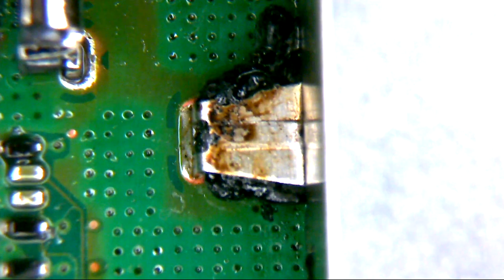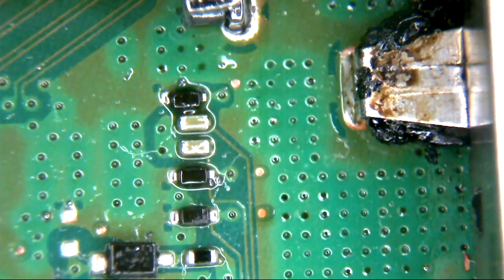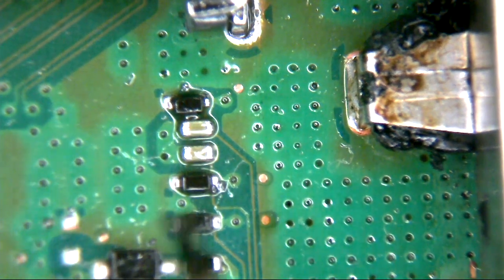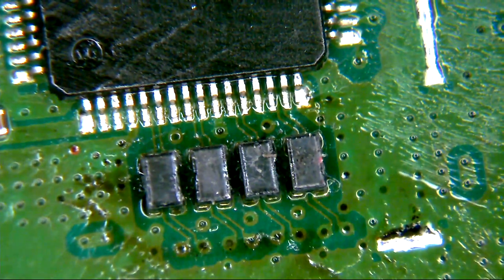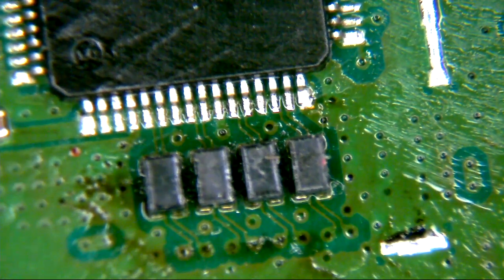We've still unfortunately got this melted Ethernet port ground pin - not a lot we can do about that. While we had the port off, we just reflowed this diode and this 2K resistor - you'll notice there now they're looking nice and straight. We've got our little bit on the backside here, cleaned it up a little bit with IPA, there's still a little bit of work to do. So this is the bottom side of the board now. We've replaced those two EMI filters - the second in from the left and the one on the far right. Those are replaced now and those are all looking really rather nice. As part of our last stage of testing when we were getting the flick of white - we had sync but no picture - so we've replaced our encoder IC which was most probably damaged at the same time as the coils were. And as you can see, that's all looking really rather nice.